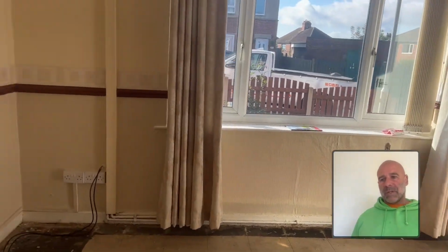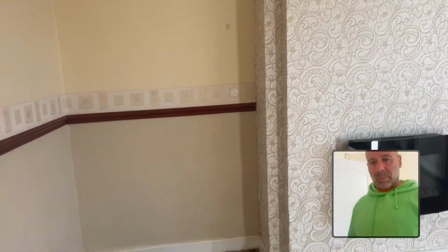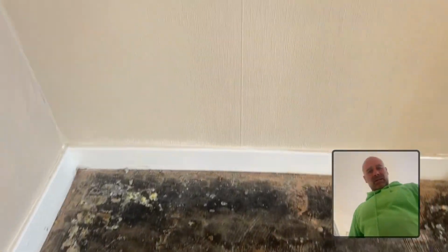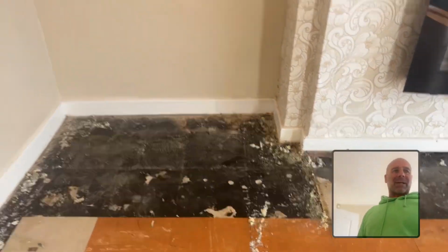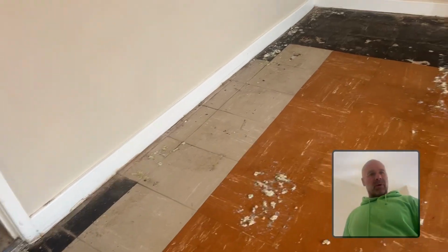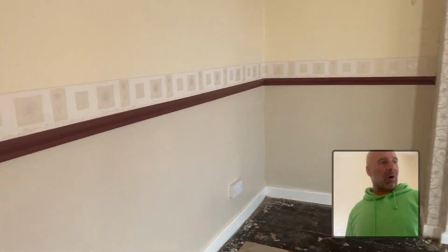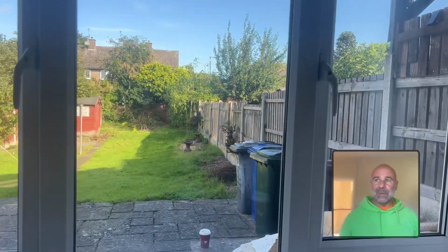So you've got a bitumen screed, so they used to put them on, mastic screed. But the other way they put these is vinyl tiles on. So they'd use like this adhesive, which is like a rubber based. So that's how you got your DPM, and then they put carpets on top, which is what they've done. But all in all, solid houses. Brilliant to buy, brilliant to rent out. Always came with a big garden as well.